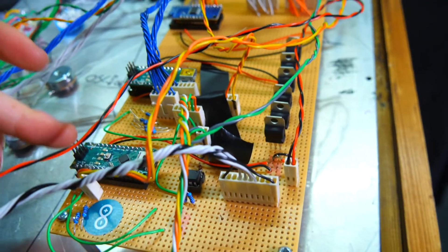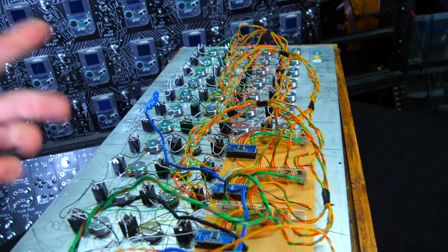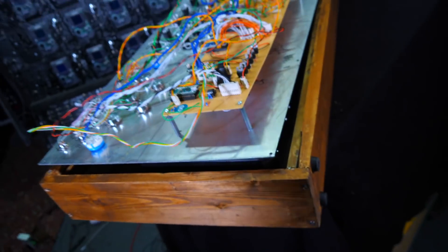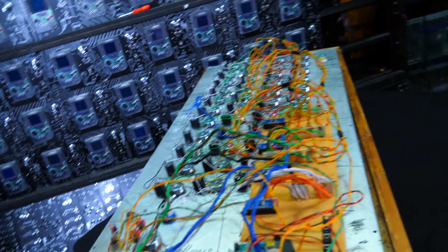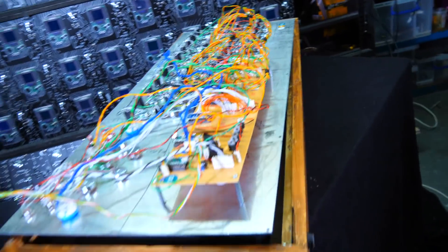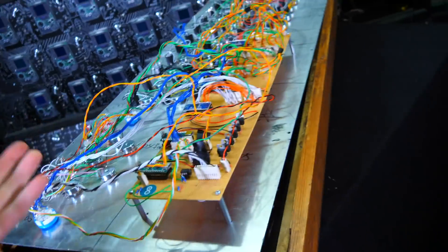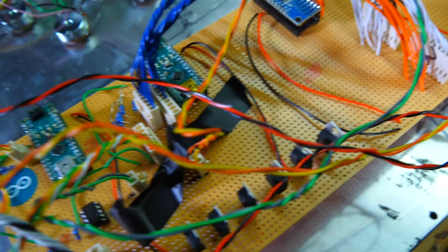This is currently disconnected because there's no use for it yet - until I'm able to make all the CC commands talk to all five channels there's no point. Also, gen MDM turns the sixth channel on the YM2612 into a noise/wave channel, which is different to the other five. So there's no point making it six-voice polyphony because one voice would sound ugly compared to the rest.